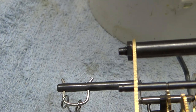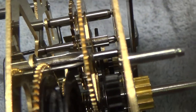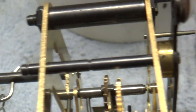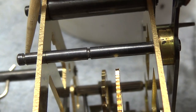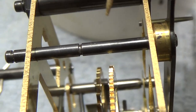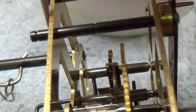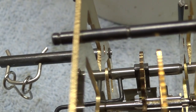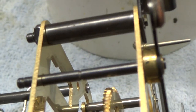This is a modified movement. You can see right now there's a cut here for a C-clip, and one right here for a C-clip. Why couldn't we just have a C-clip right up against here or right up against here to keep that lever from coming out? Well, because this lever has been modified to run the music box, but originally what it was,